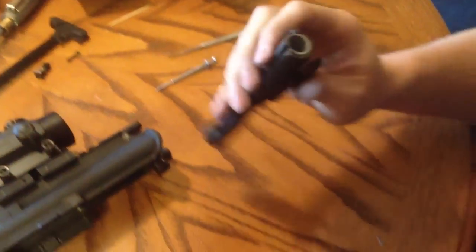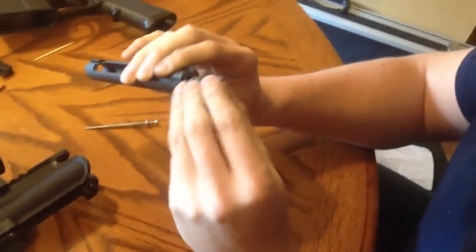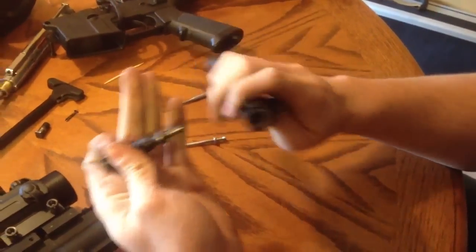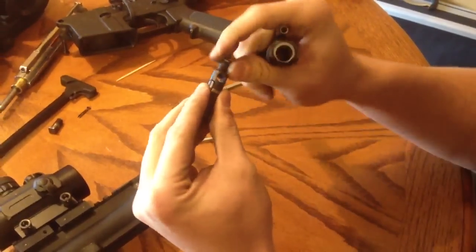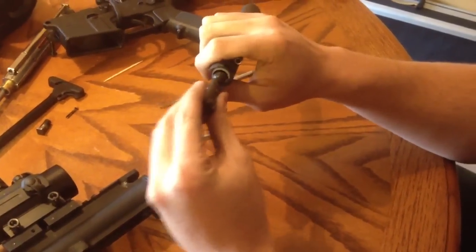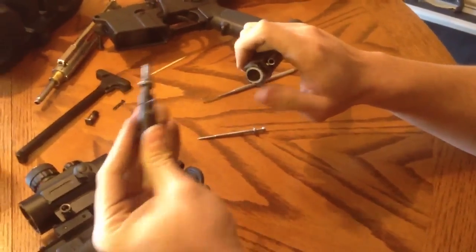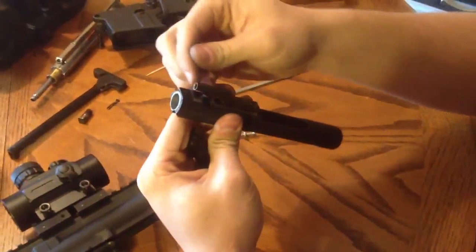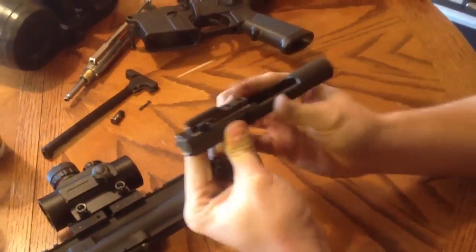On the flip side, your bolt rests in here. There's a bunch of carbon buildup back there, and if it builds up it's not going to operate right — it'll jam this part up and it won't push all the way back and come back, it'll cause misfires and stuff like that. This back here really gets dirty because this is where all that gas is injected back after you fire.